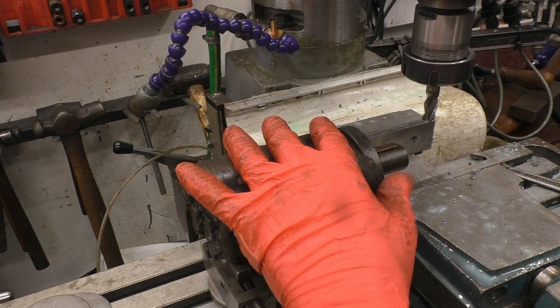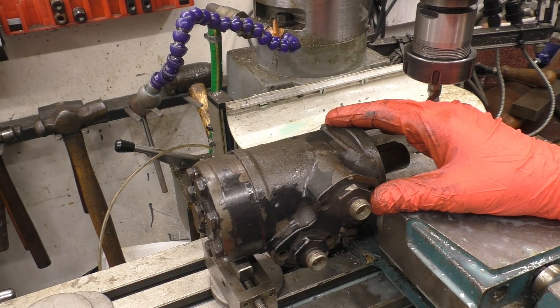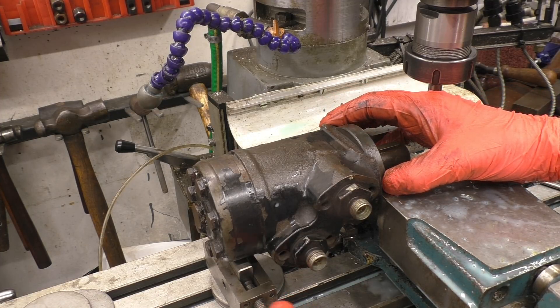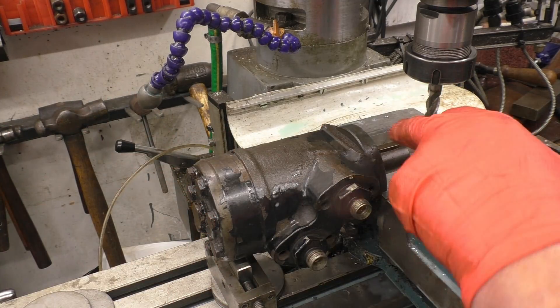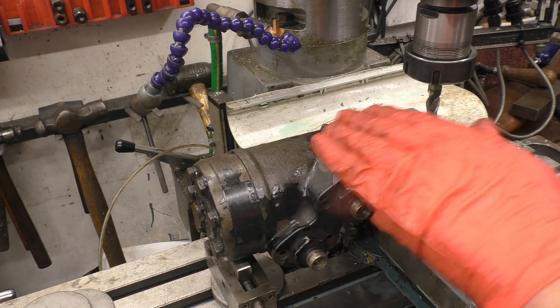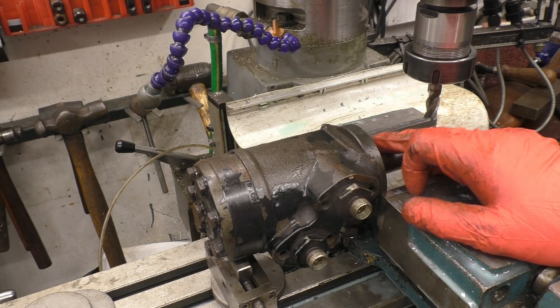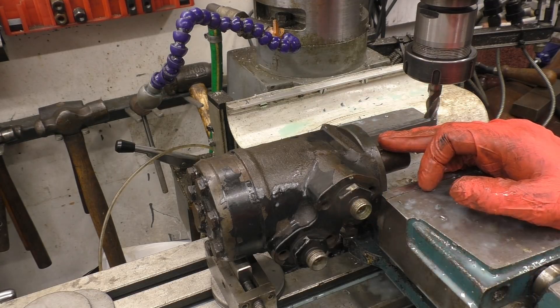The idea of using that angled plate on here wouldn't work because my angled plate isn't big enough — the stud centre isn't big enough. So I can grip that flange in the vise, and I've got a jack onto the back so I can square it up, put a clamp on there, and use that key to make sure it's lying level. I'll clock in on that key there, get it lying level, and then we can clamp it down and machine that bit out the back.